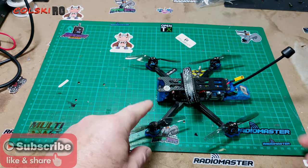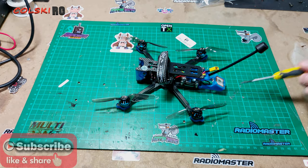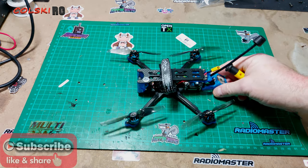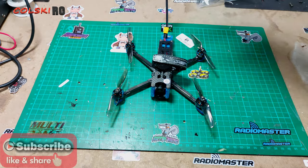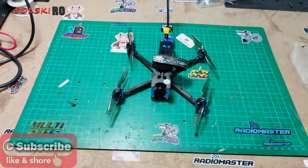And it was always difficult to get it to arm, even when I had the full 14, 15 satellites, and they were telling me it was okay, so there was no problem there. I was still finding it difficult to arm, no matter what I did in Betaflight. So I left it that day. Next day I came to it, and eventually it started to bind, and it seemed fine every time after that.